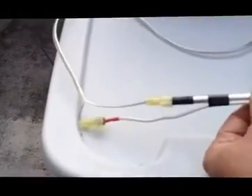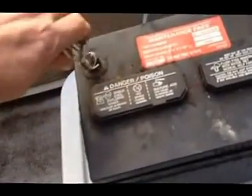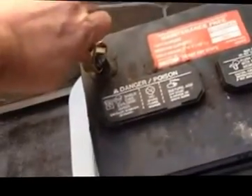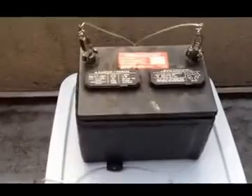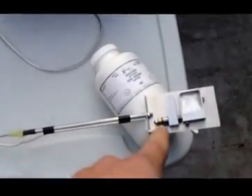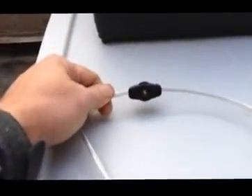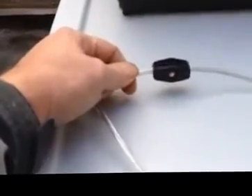Strip the ends off the wire, put the blade connectors on the end, and crimp them down with a little crimper tool. Over here on the battery, I bought two large alligator-type clips that clamp onto the battery. It's a 12-volt battery — there's no fear of electrocution; 12 volts with the number of amps coming through is not going to be deadly. It draws maybe three or four amps. I also built a little switch — I bought that switch and installed it on the middle of the speaker wire. It's just a lamp cord switch, a couple bucks.